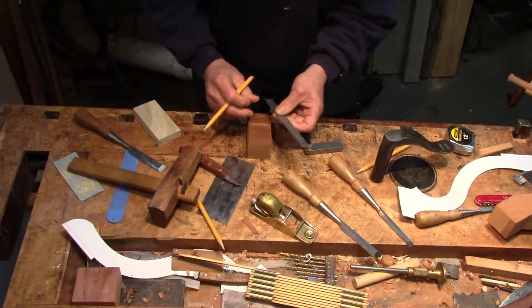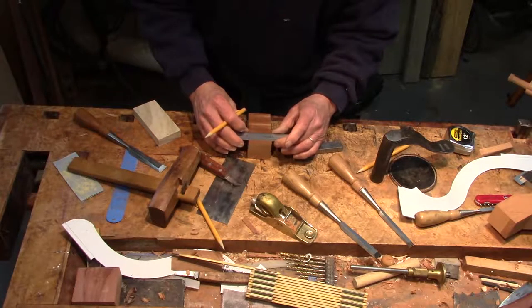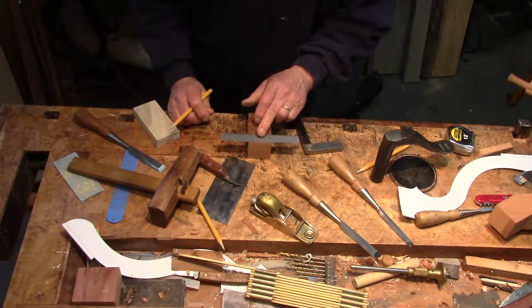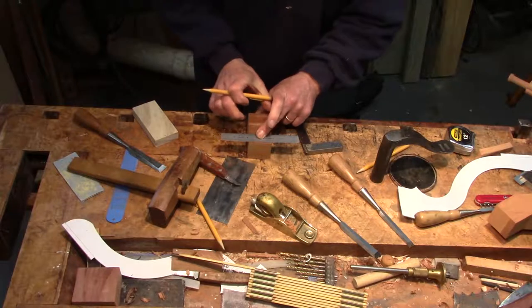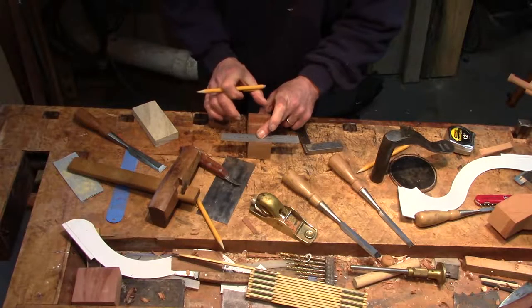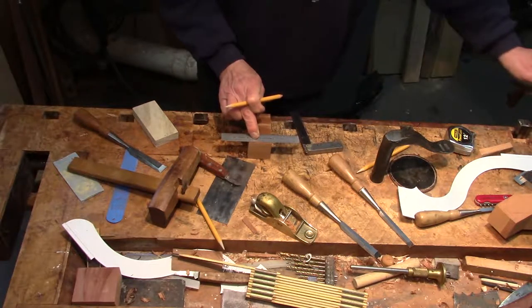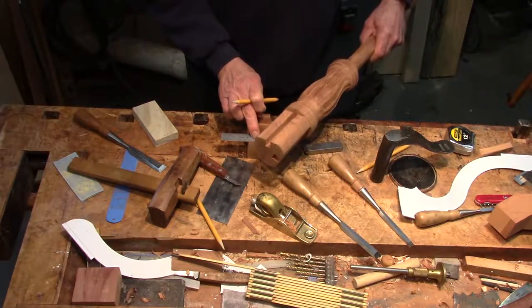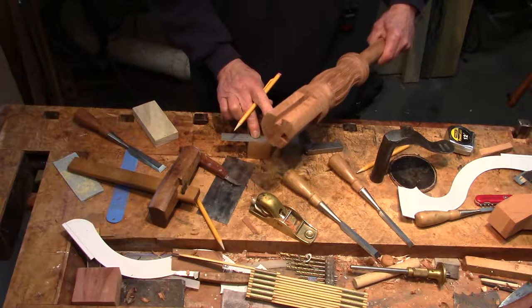with the post. So I want a dovetail now that is 9/16 inch wide on this face. By the way, the thickness here is 1 3/4 inches. The design thickness is 1 5/8, so I'm 1/8 heavy. I want to make sure that it is a little bit fat so that I can adjust it to match up with the flat part on the post.